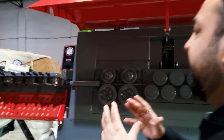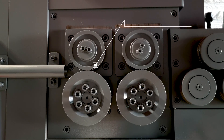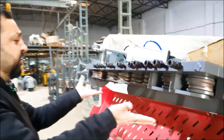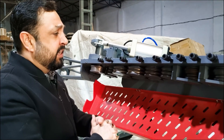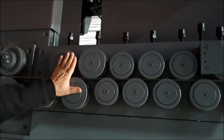The pre-feed motor feeds to the traction wheels. These are the traction wheels — once the steel is here, we clamp this and unclamp the pre-feed motor. There are two sets of straightening wheels: one is horizontal wheels, which straighten horizontal bends of the rebar, and the other set is for vertical errors.